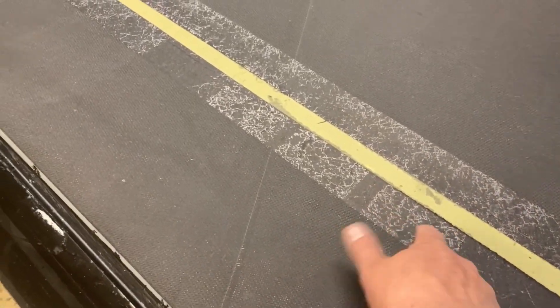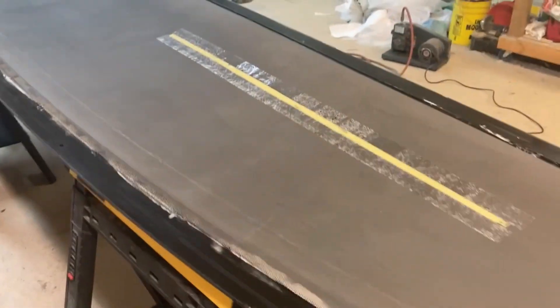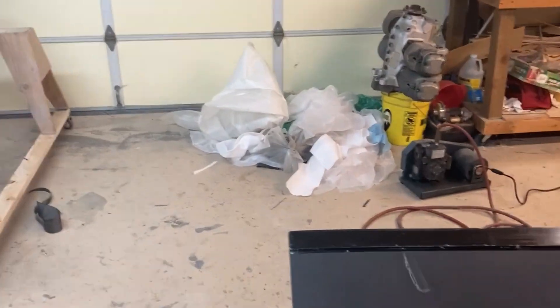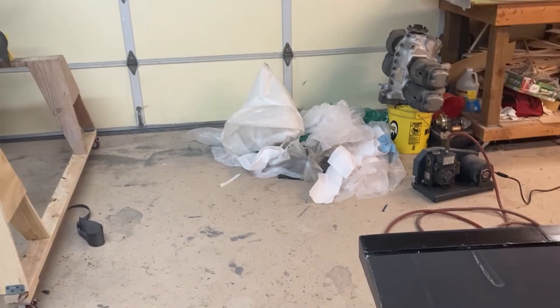Came out fantastic, I'm really happy. You can see the hinge line, and this light-colored stuff is the scrim that holds the unit together — it just catches the light a little bit differently, so it always looks weird, but it's great. No voids, no issues. And in case you're wondering, that's what all the consumables look like — that's a big reason why composites are expensive, because you waste a lot of stuff just to make it happen. But totally worth it.